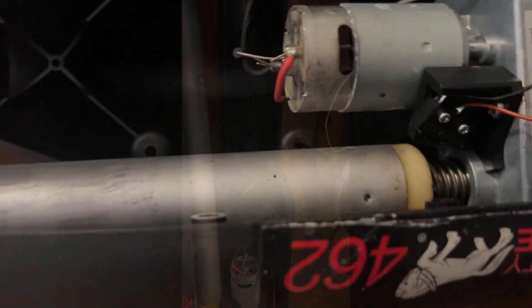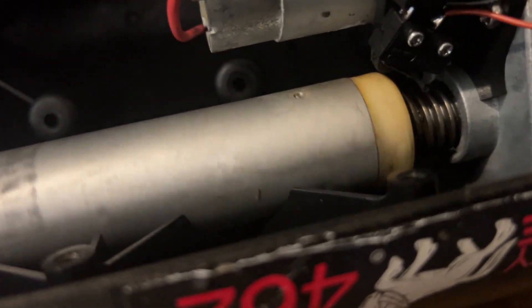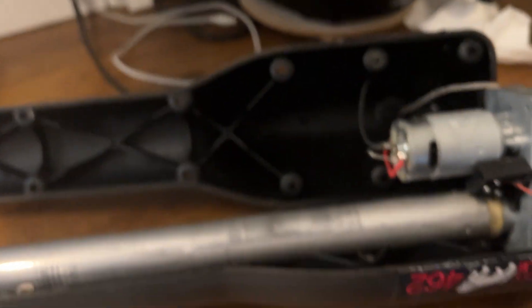I dried it up with a towel and now I'm hitting it with the hair dryer. Nice and dry. Now I noticed something that looks a little strange. This solenoid switch seems to be working — it's got nice pressure. But as you can see, the arm is not touching it. So I'm screwing it from the other end. There, it just engaged the solenoid switch. So I'm going to screw it all the way in. I probably unscrewed it trying to make it fit the gate somehow, and maybe that was part of the problem.